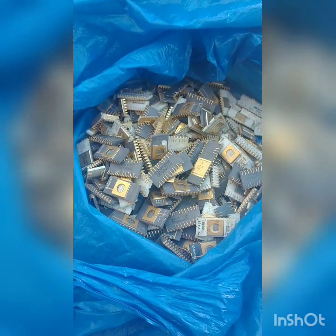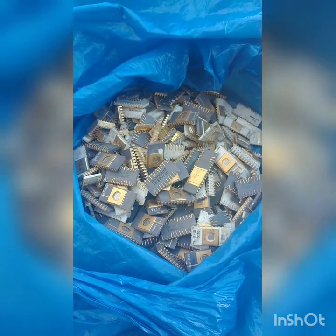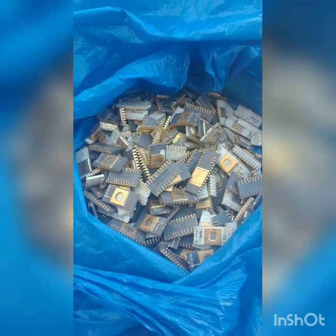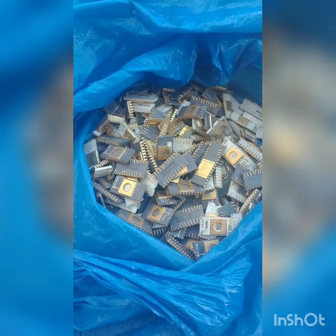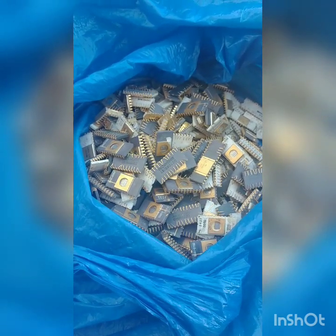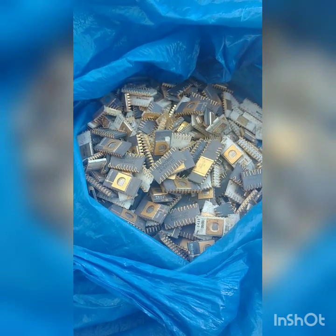Hi guys, E-Waste Solution Sunny here. Today we're going to be doing some refining, and as I get more subscribers and make more videos, I want to take some time to talk about safety. Working with acids, the salts they create while dissolving metals, and the fumes — the processes and leachings occurring are extremely toxic and deadly. You will kill yourself in the long run if you do not wear PPE: gloves, respirator, eye protection, the whole works. You'll destroy your property, your neighbor's stuff, and cause harmful effects to the environment, animals, and drinking water.